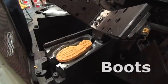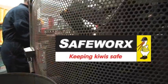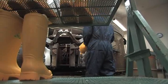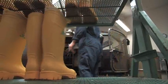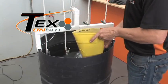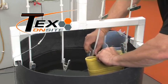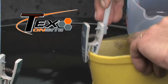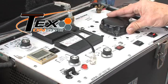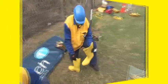Creating a barrier around the work area prevents those without dielectric footwear from entering an area where there may be a risk of step potential. The dielectric boots are manufactured locally and sold through SafeWorks. They have steel-reinforced toe caps as well as sole inserts for comfort. Before they were accepted as suitable for this purpose, TEX OnSite conducted stringent tests on the boots, subjecting each one to 10 kV for one minute. Once tested, the boots were stamped with the voltage level used and the next test date.